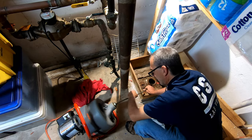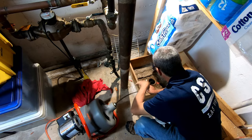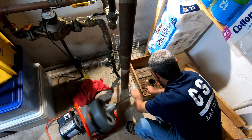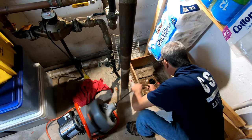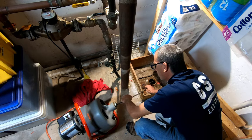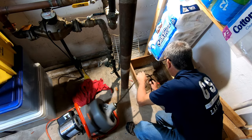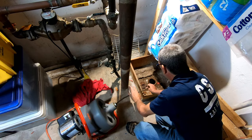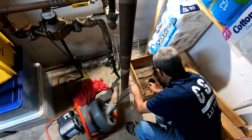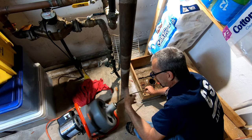I'm listening to the sounds, and when you get it you'll hear the water go right through. It's spiraling — this is what I like — and I want to keep pushing it slowly through. Be careful with the slack in the cable. I do a long period so it can cut the roots.